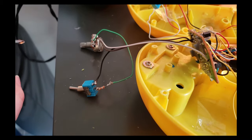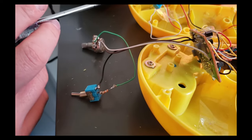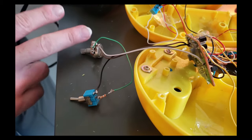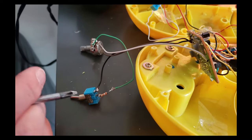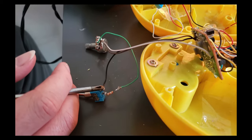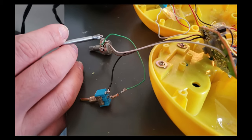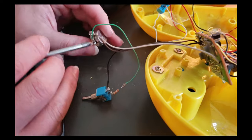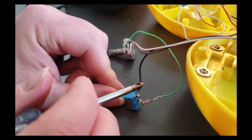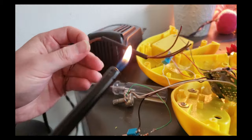The touch points are going to be a bit different because normally you'd add them after the resistor, but I'm afraid that if I add them post resistor, then we're not going to have a good range on the touch points due to the internal resistance build up inside of a person's body when they actually touch the touch points. So what we're going to do is run this pre-switch, and I'm hoping to not have to have a resistor on this main one. We're going to run it out, and then we're going to run it from these two, and then these are going to be our three touch points. So you have positive, negative, and then you have your median pre-switched and pre-resistor, and hopefully that's going to give us enough range where the touch points are pretty fun, but they're not going to be crashing it.